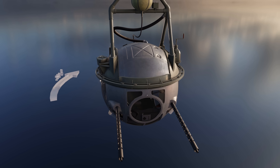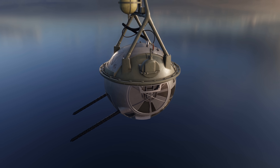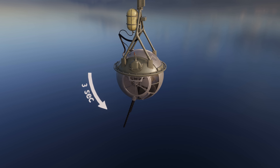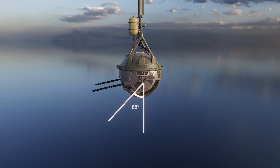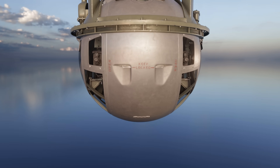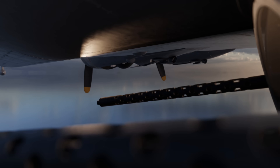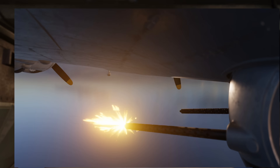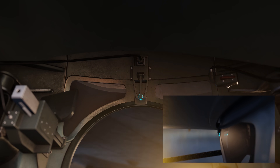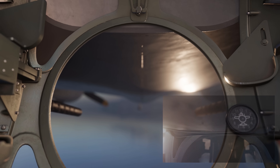When operating under power, it could rotate 360 degrees in 8 seconds and move up or down 90 degrees in 3 seconds. It had a maximum elevation of 85 degrees from the vertical. The turret ring had a forward-facing cam fitted. This projected down from the ring and was contoured to mirror the arcs of the propellers. When the turret rotated to face forwards, a pin on the turret front situated above the main sighting window touched the cam and cut power to the solenoid firing circuits for the guns, so that the gunner could not accidentally fire into the aircraft propellers.